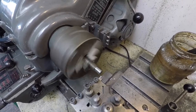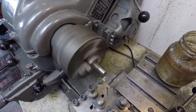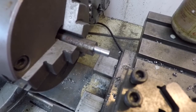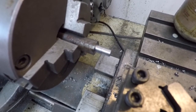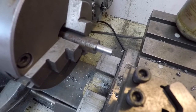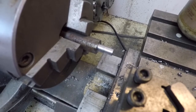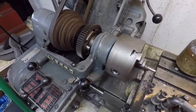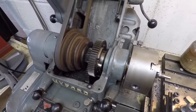It's probably about as long as we need for this particular job, so I'm just going to turn that down to just shy of six millimetre diameter. There are two separate diameters at this point. The bit on the left is just over six millimetre diameter — just roughed out. The bit on the right, where the thread is going to go, is just under six millimetres to give an easy action on the die. Now I've put the lathe into the slowest back speed gear.